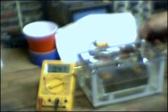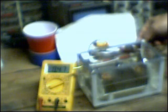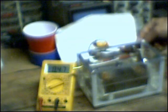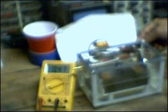At 96 volts we are drawing approximately almost half an amp — it is 470 milliamps — and there is some gas visibly rising off the electrolyzer cell. The voltage is being generated by a variac, which is a variable AC transformer, fed to a full wave rectifier bridge filtered with a capacitor, so it should be fairly good DC. The average DC voltage is 96 volts.